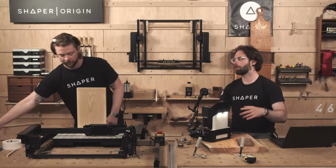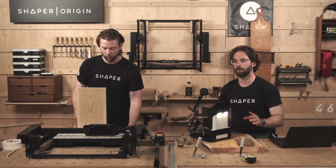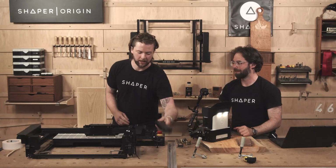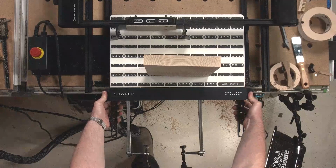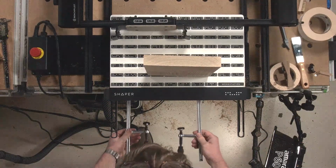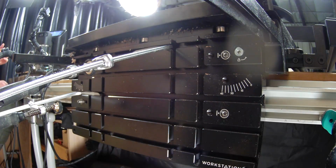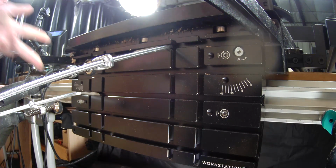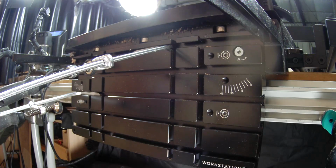Let's slow this down a little bit, though, and walk through the setup on this one, because we breezed over the bow tie thing. Jake's always setting up with clamps on either side. Got that support bar there. And then last thing that we want to check is that the 2 locating pins on the left-hand side are screwed out, which is going to give us our vertical reference. Very nice.